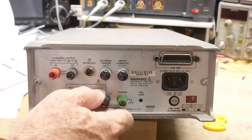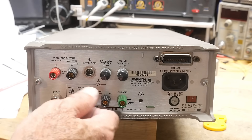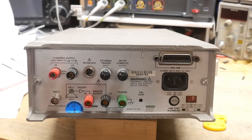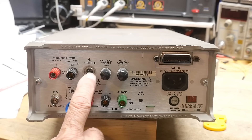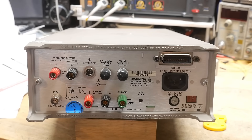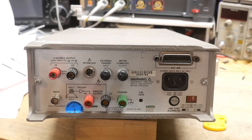There's an analog output which appears to be just for driving a strip recorder or plotter. There's also an interlock connector — this thing outputs plus or minus 500 volts, so if you want to run above 50 volts you need the interlock to keep it safe. That's a really weird connector so I'll have to find one. There's also external trigger and meter-complete output, so when the integration is done it signals that the data is valid. There's a cal-lock I've never seen before.